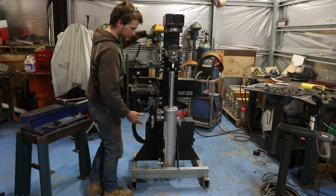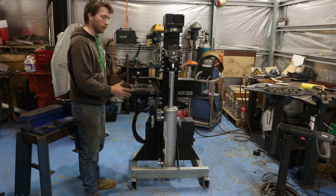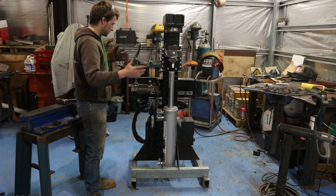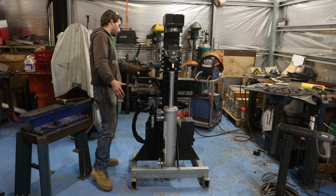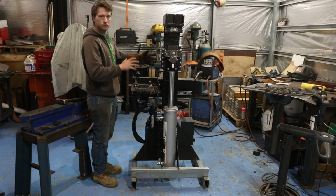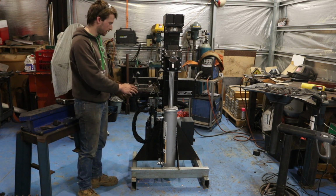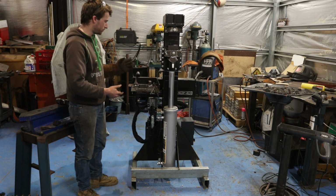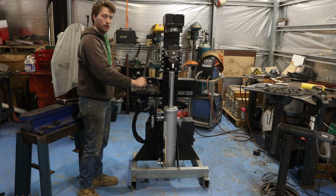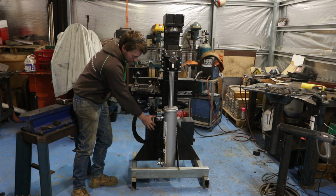So this is the kit. It's got a frame that I can fit a pallet jack under, which makes it easy to move around. It's 800mm wide, 700mm long. Probably with all the hoses and stuff, you want to allow at least a 900mm footprint. We're using part of the shelf that comes with the log splitter as a guard on the side. Probably shouldn't, but I've been using it to keep all the dies and a bit of scrap steel and a pair of tongs. Use it as a shelf, but it's mainly there to protect all the hosing that's underneath here.